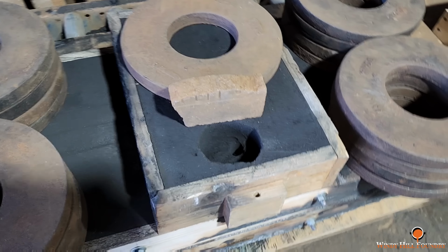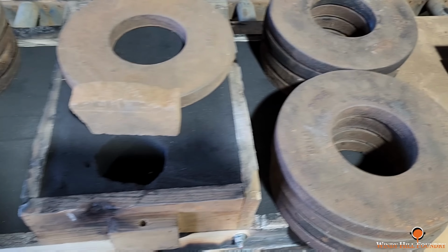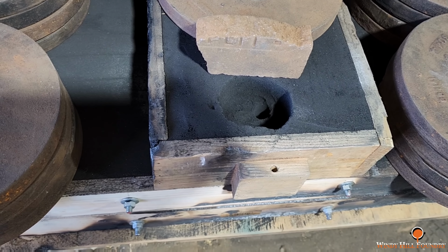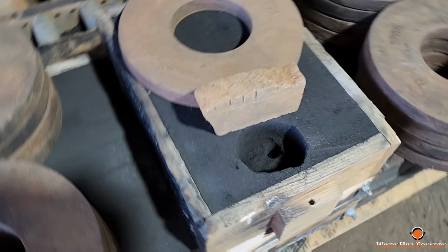There's a second mold you see up here that contains the actual pouring basin, as is with this one. The reason for that, first of all, I've been having trouble, as I showed in my last video, where I'm bumping into my weights with that shield that protects my left hand. Now we have actually got the pouring basin moved out here to the edge. The other thing is we have incorporated a filter trap in the system.